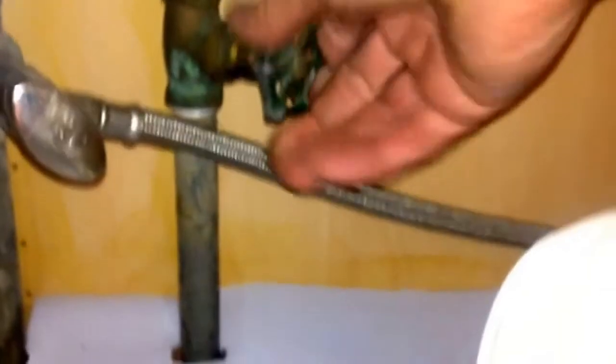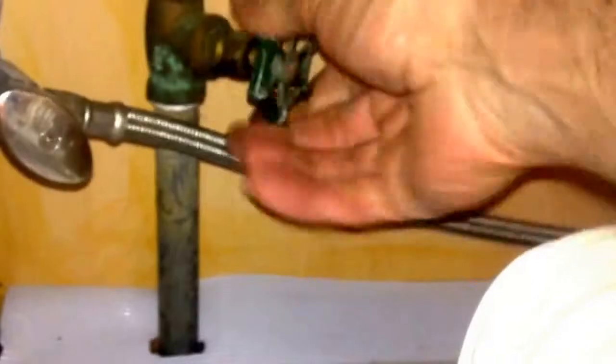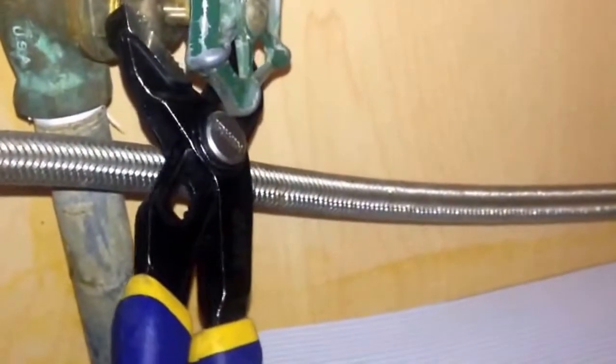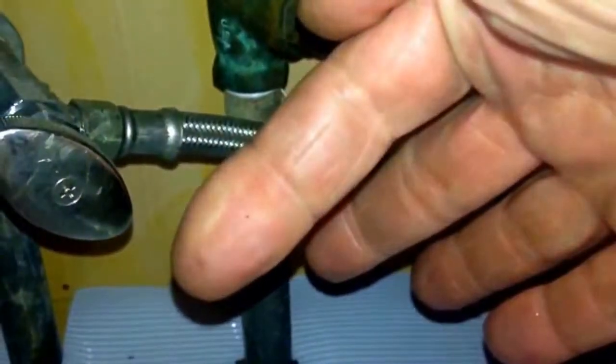The next thing we're going to do is open the valves so we can check to make sure before we button it up — which way is cold, which way is hot. You can see we're leaking a little bit here from the valve. What we'll do is tighten up this nut that seals the valve, and the same on the other one, and just mop up the water. Then recheck the valve — stick your finger underneath just to make sure there are no more leaks. Nice and dry.